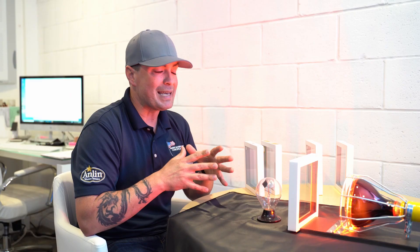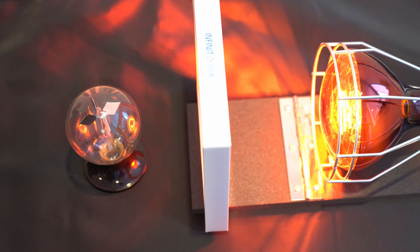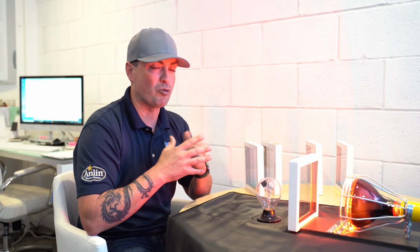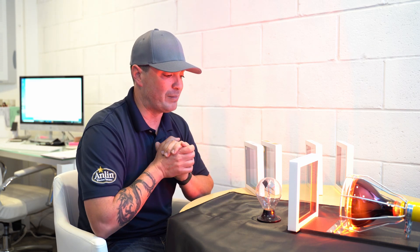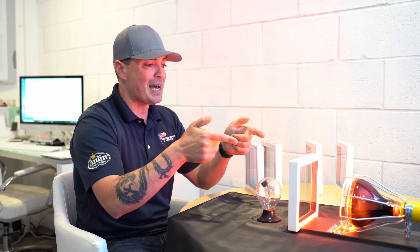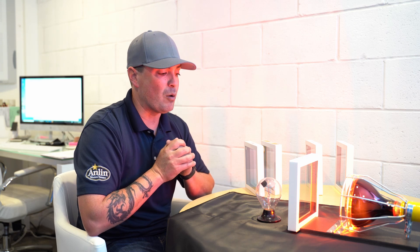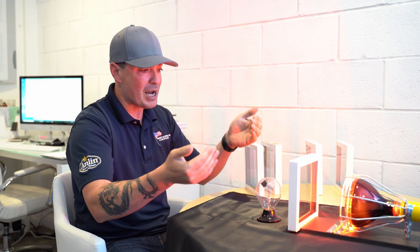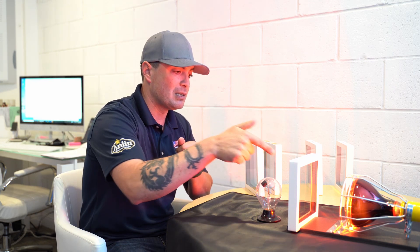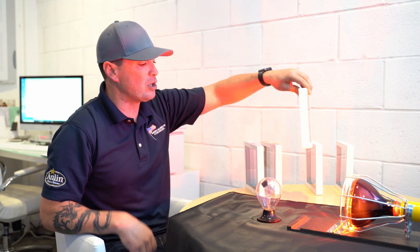Now this test can be taken wrong. Some people will say that low-E will stop the sun rays throughout the entire day and you'll never have any heat gain come through the glass, and you should never feel any warmth to the touch. Well, that's just not true. This is just a test to show you how the low-E actually works. But if we left this cooking for an extended amount of time — let's say an hour or so — this would start to slowly move again because that heat transfer is actually getting through the glass and working itself on the interior pane. It has stopped, but probably after about an hour or so you would start to see it move.